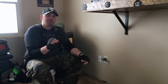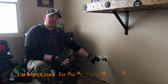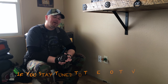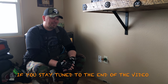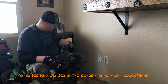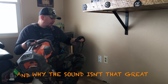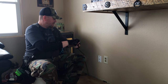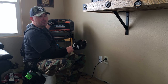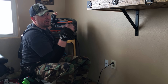The next thing we'll want to do is turn the power off to this outlet. If you've got somebody who can stand here and watch these lights as you turn each circuit off at the circuit panel until they go out, that's great. But if you're working alone like I am today, I've got a little trick — just unplug the circuit tester and use your alarm clock or a radio or anything that makes noise. Plug it in, turn it on, and you'll be able to hear it at the circuit panel. Shut each circuit off one at a time until the sound stops.